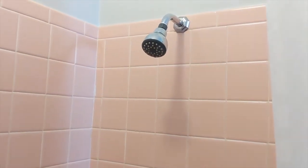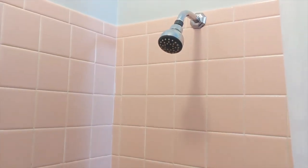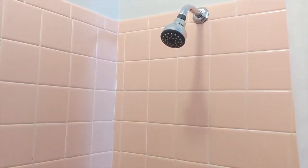Then on the third day he came back and mixed up Portland cement with fine sand. That was the original thin set. He set these tiles in that mixture. It was really critical that he come back the day after he had put that mud coat on, so that the thin set got a really good bond to the concrete that was essentially underneath — all smooth and plumb. You don't want to wait a long time.